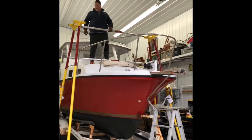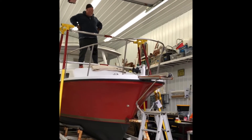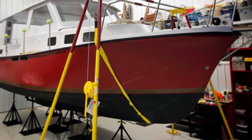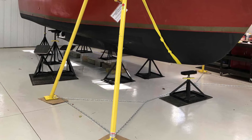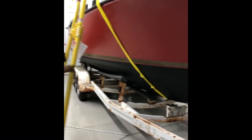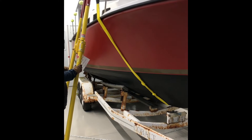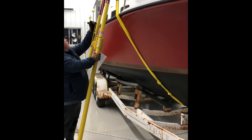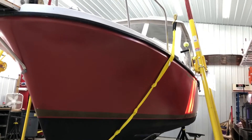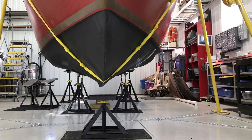The GoHoist is made out of metal — the top cross members are aluminum, but the rest is all steel. Each piece is somewhere around 48 to 52 inches long and they all assemble together to build a hoist that will lift something essentially 12 feet off the ground. The hoists have feet that go on the bottom and can be reinforced with chains to prevent the legs from spreading. On each side of the hoist is a ratchet mechanism — a hand crank. It doesn't require any power or hydraulics; it's simply a ratchet cranking mechanism on a steel cable that raises the harness to actually lift the boat.